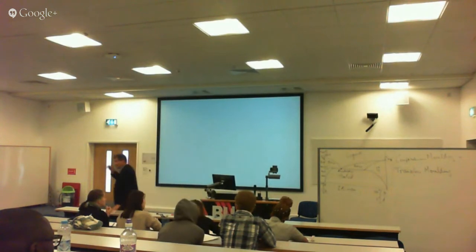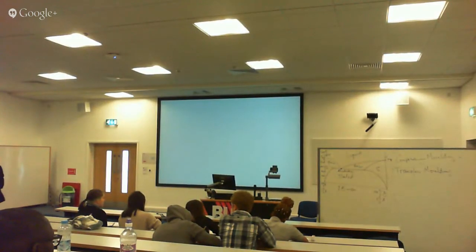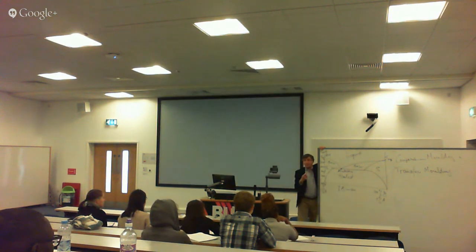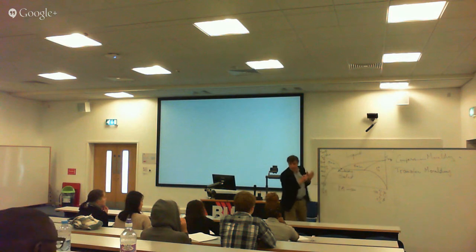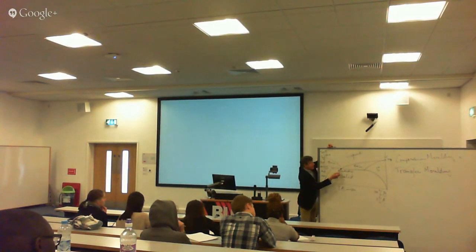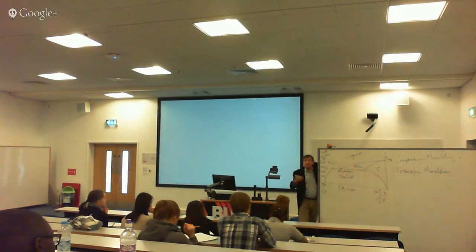Eutectic is a Greek word. It means easy melting. What does it mean? For this alloy system, it is the particular percentage that gives you the lowest melting point. If you have an alloy with this composition, it melts at this temperature. Of all these mixtures, this is the mixture that gives you the lowest melting point. This is what you take.